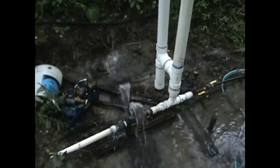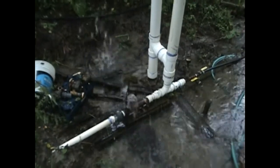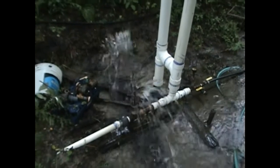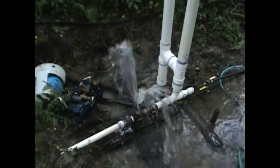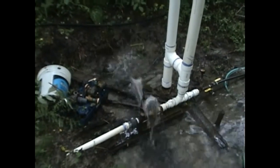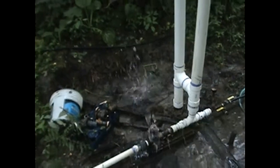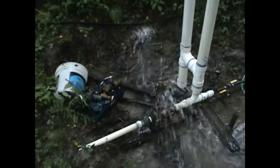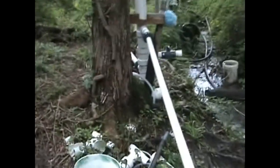I filled the 4,000 gallon pool several times and used it for irrigation, and had to flush it once or twice for algae reasons. After the pool is full it fills the upper reservoir, and after that we're overflowing — there's been a good amount of overflow time even after filling the pool. It takes about three and a half days from completely empty to fill it back completely full, and that's a little over 4,000 gallons.